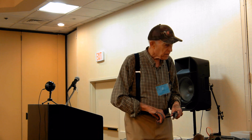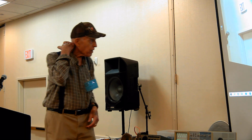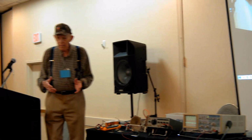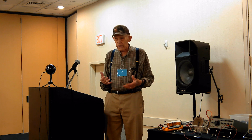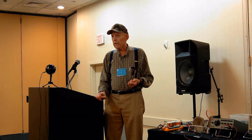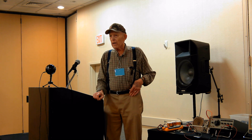So the bottom line is, I don't wanna buy a digital scope again, because I found out the way they work is they take in the signal in memory and they analyze the hell out of it. They'll do an FFT on it, which tells you what all the frequency components are, and it's very democratic. It lists them all. So if you have any distortion in the signal, it's going to tell you all the signal components that are in the signal, all their frequencies. And you don't want to know that most of the time.